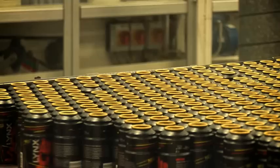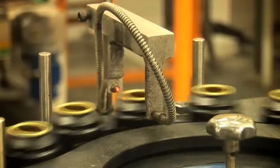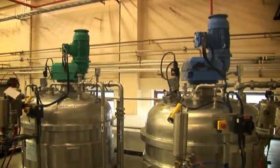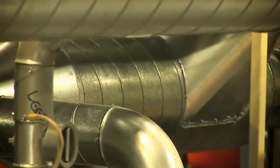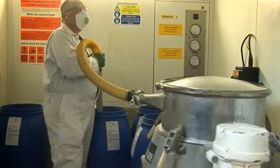When it comes into our plant, we're producing good product that's going to go into cans and end up on supermarket shelves. We move up from the pilot plant level of 30 litres to two tons — roughly the weight of two family-sized cars. Transporting the raw materials into the vessels becomes a challenge. We can do this by bulk raw material feed, piping the bulk material straight into the mixer, and also adding powders using a vacuum system.